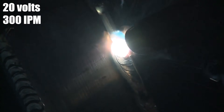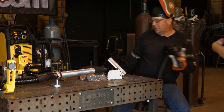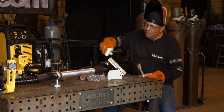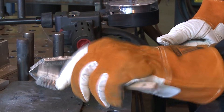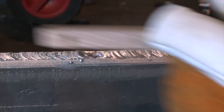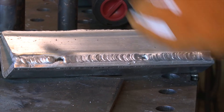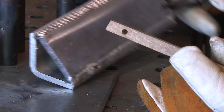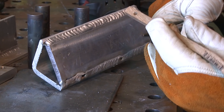These are short welds but I'm remembering these values. I didn't like that first one - it was too cold and splattery. The second one wasn't bad but started to pop a little bit. This last one started to get a little wide up here because the heat was racing through. If I had to go back and look at this, I'd probably take the second one. If I couldn't position my work all the time, we have the option of doing this downhill thing or hitting the numbers going uphill. Be open-minded to values and value changes, heat input and all that kind of stuff.